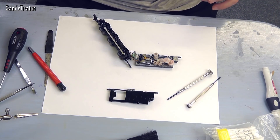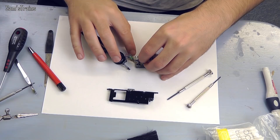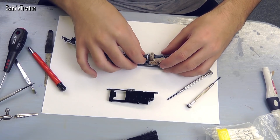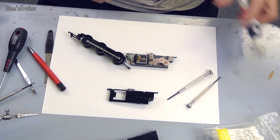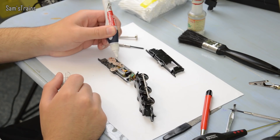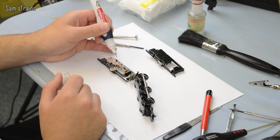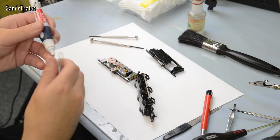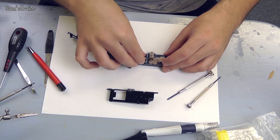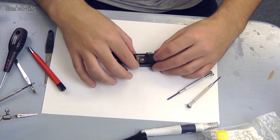That's come off and as you can see there are all the gears. The eye mechanism has got so much torque — it goes so slowly it doesn't really need to be lubricated that much — but we're going to lubricate the gears anyway just to make sure everything is going. Here are the two gears which power the wheels — that's the important set — and then you've got these which power the eyes. Put only a little bit of oil on the worm drive from the motor and a little bit on the bearings, because if you put too much it's going to flood the motor and get onto the brushes and the commutator and burn.